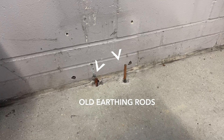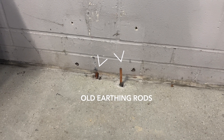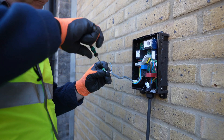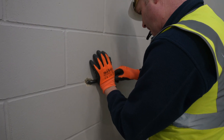The EV box needed a dedicated earthing rod which made the entire setup extra complicated. The earth rod shouldn't really be needed in normal use — it is present just in case something goes wrong to make sure that the car won't suddenly become live. The Hypervolt uses clever electronics to check for any faults, so it doesn't need a dedicated earth rod, making the install easier and neater.